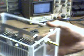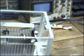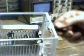You'll also notice I have a quarter-inch barbed fitting to quarter-inch MIP tapered thread. I was debating how I was going to mount this in the acrylic, and an idea came to me. I drilled it just big enough to start the threads, heated it up slightly with a torch, and then allowed it to melt its own threads as I screwed it into the acrylic — which is what I did.